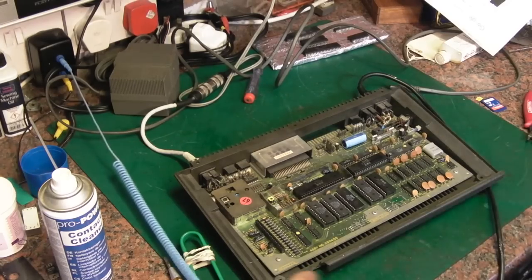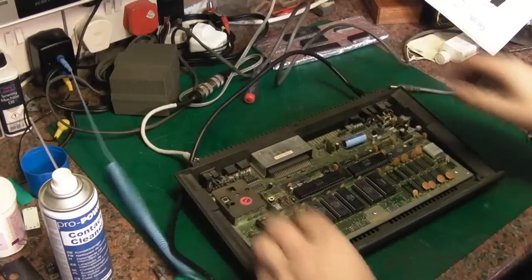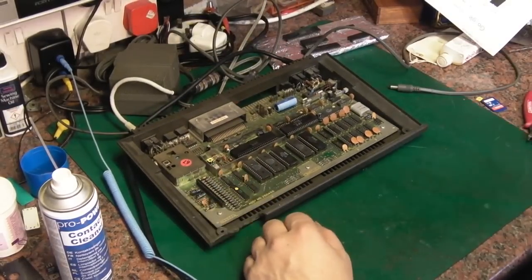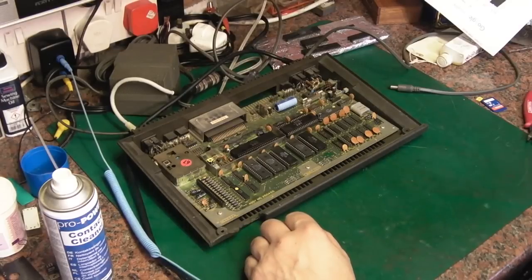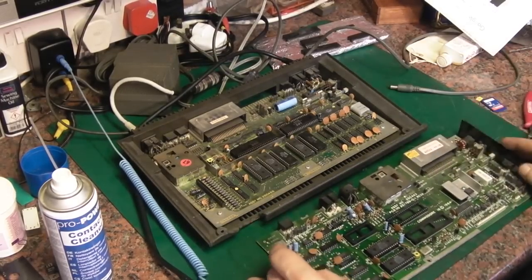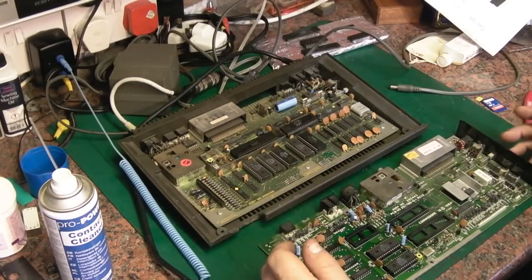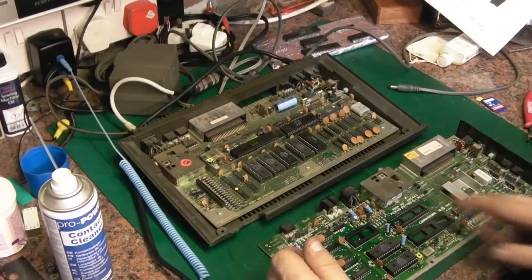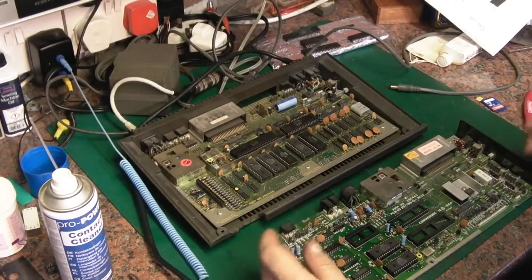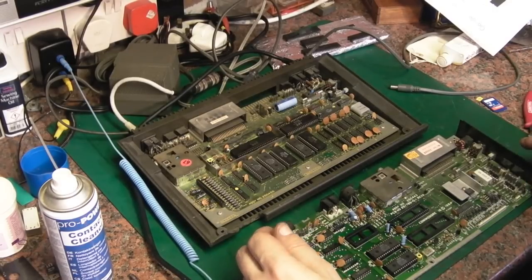Okay, I'm back. That's better. I've had something to eat. Right. Without further ado, I've got the Plus4 still set up there, and I'll bring this. This is the last board that we worked on. It's basically doing exactly the same as the first board, just getting the black screen. Like I said, it looks like the TED is at least firing up, because we are getting some form of graphics off it, but it's not actually displaying anything.